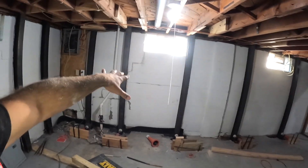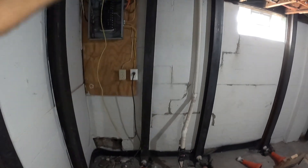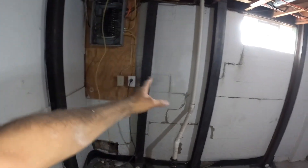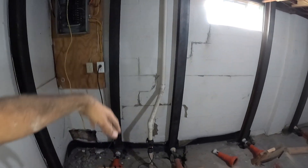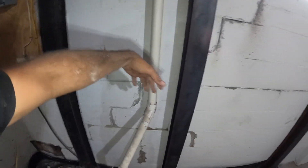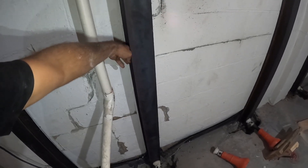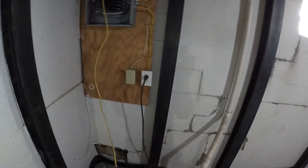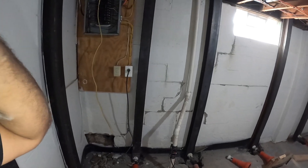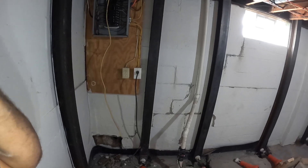That's the way some of these basement jobs go — they're not going to be perfect, it's not going to go back a hundred percent. I actually ended up having to add another beam, which I'm going to leave in place. I was not able to push it back even using the trick of sliding the beam out and sliding the wood down through here — a 2x6 or 1x3 — to give you a little bit larger area that you're pushing. Tried to open the cracks. Just unable to push it back completely.